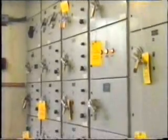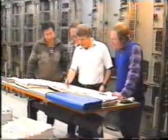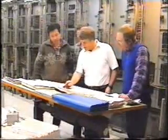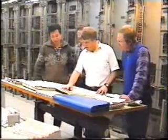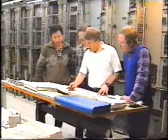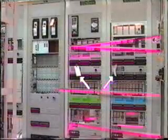You must be completely familiar with your company clearance procedures, including tagging. Before commencing work, the test crew should review the scope of work to be performed, check prints, and identify potential hazards. For example, if a test voltage or current is to be applied, any secondary circuits and exposed connections should be isolated and tagged as they may become energized.